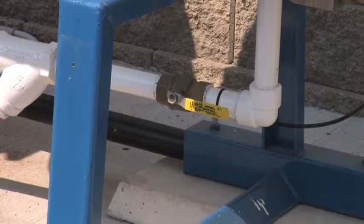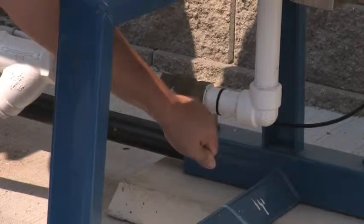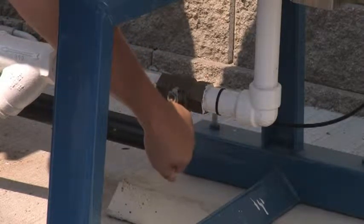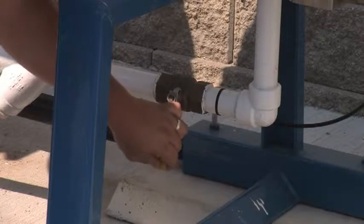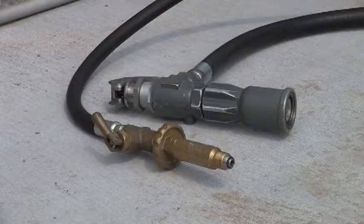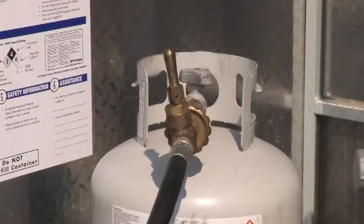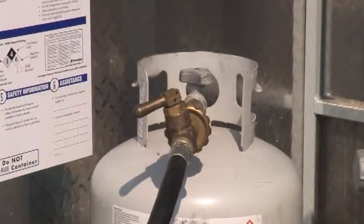Ball valves control the flow of propane from the supply tank through the piping. A ball valve is open when the valve handle is parallel with the piping, and closed when the handle is perpendicular to the piping. Globe valves are similar to water faucets and are operated by turning the hand wheel counterclockwise to open and clockwise to close; they must be either fully open or fully closed. Hose end valves stop the flow of propane as part of the container filling operation and are quick closing or snap acting as a safeguard against overfilling. Many also have a safety latch to prevent accidental opening when not connected for filling.